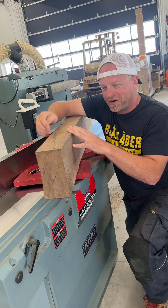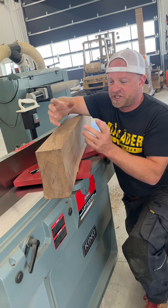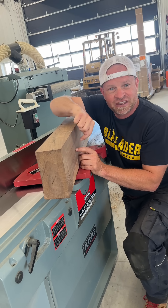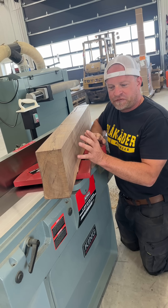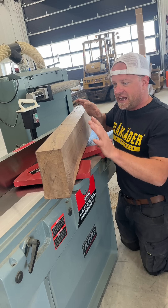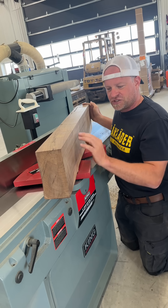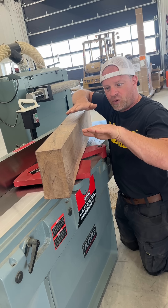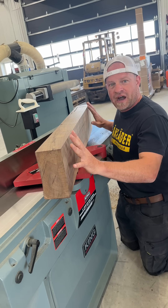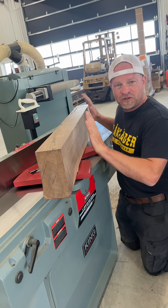It might be 90 right at one point but shaped a bit like a trapezoid without equal distance — and if you're doing a table glue-up and want all your boards uniform, you need to be cutting in reference to that flat face, not the opposite side. When we did our first passes we weren't going in reference to anything — I was letting the knife, table, and structure find a flat surface. As the board went over, it took off the high spots until enough of them were touching both the infeed and outfeed tables to produce that flat surface.